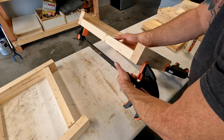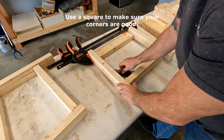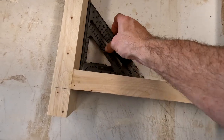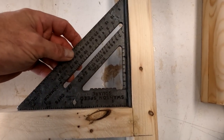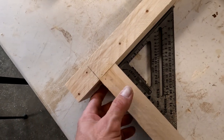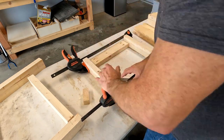Standing it up without losing my clamp. If the board is twisted, you can be square on the bottom but not on the top. You can make this as perfect or imperfect as you want. I've got a little warp in my board so I'm going to clamp it, put the upper screw in, then push up a little and tighten the bottom screw. I'll go ahead and tighten the clamps and use 2 and a half inch pocket screws.